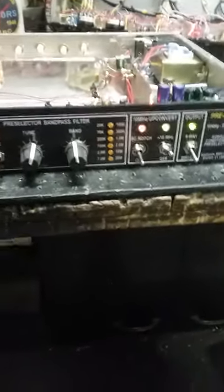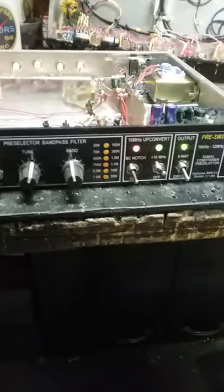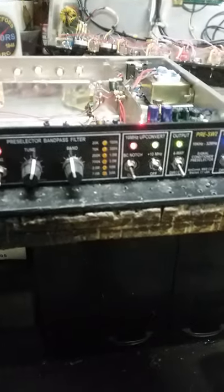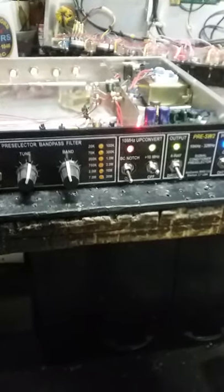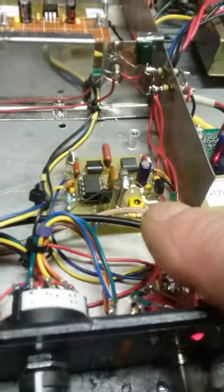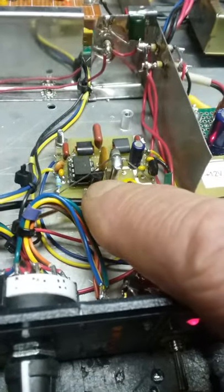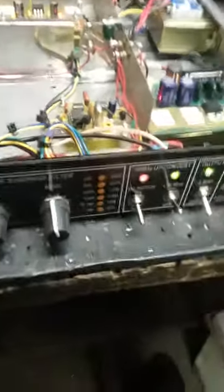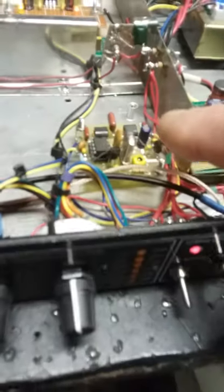The reason I did this is that most general-coverage receivers are very good mid-band — anything above about 2 MHz they're usually pretty good — but they're not so hot in the broadcast band. A lot of them have built-in attenuators because they're dealing with strong local signals and don't want IMD overload. So I reasoned that if we up-convert everything to the 10 MHz range, we're going to do pretty well. It really, really, really works — that's three reallys. The little converter is an NE602; there's another YouTube video on this. It's clean, simple, KISS principle — it works.